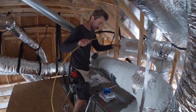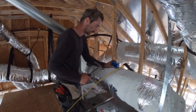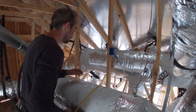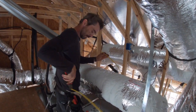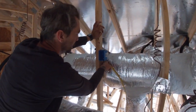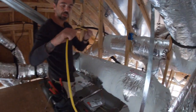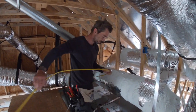I ran this wire and put a staple down there, and this is going to be my junction for my disconnect. I'm just going to pick an area that's easy for me to work in, above and behind it. This is my power coming in from my panel, and this is going to be my switch load — it's still just one hot, a neutral, and a ground.